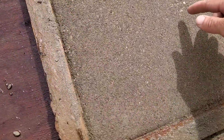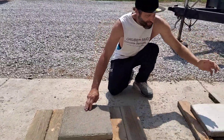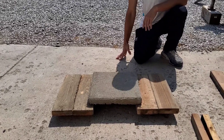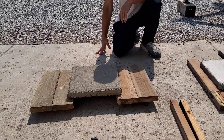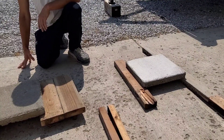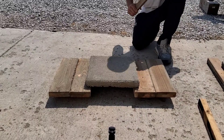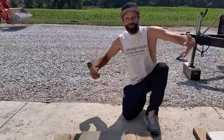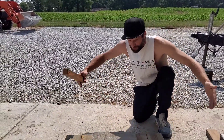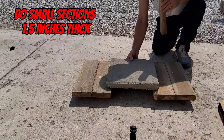I think I'm actually pretty optimistic about how strong this is going to be. Today we are testing dry pour mix versus regular concrete. They're both bag mixes out of the same material, same store. I just don't think the dry pour is going to hold up like the mix out of a mixer. I just think this is a lazy man's way of doing it. It might be lazy, but you've got to look at your pros and cons. A lot of guys don't know how to do regular concrete and they're scared of it. I think you can control it a lot easier when you're only doing it this small, but when you've got a bigger section, I think it'll be harder. I think if you do do it, you should do it an inch and a half thick, because that'll get most of it to soak through.